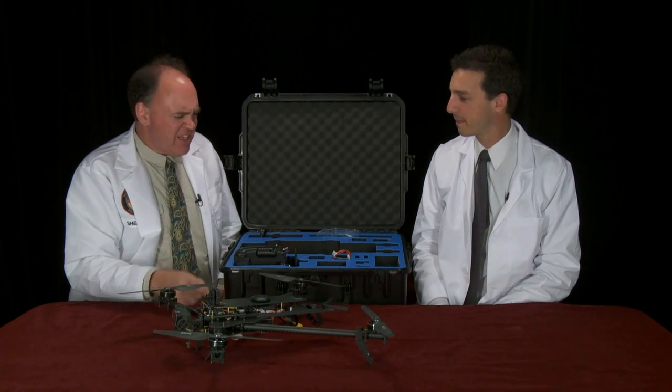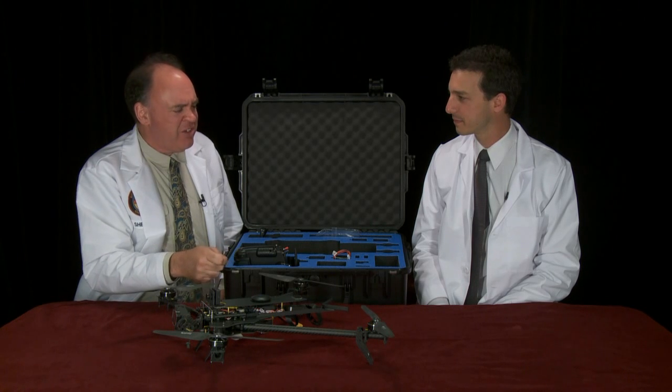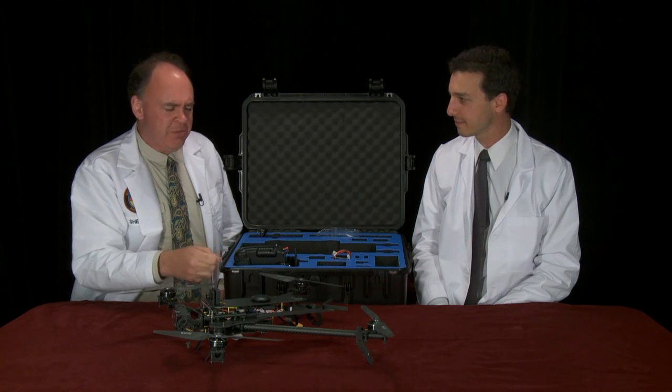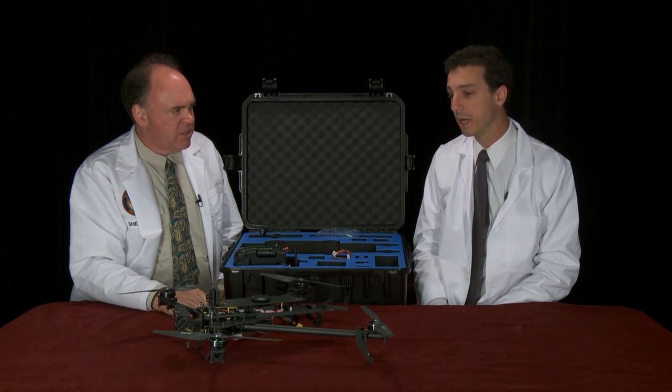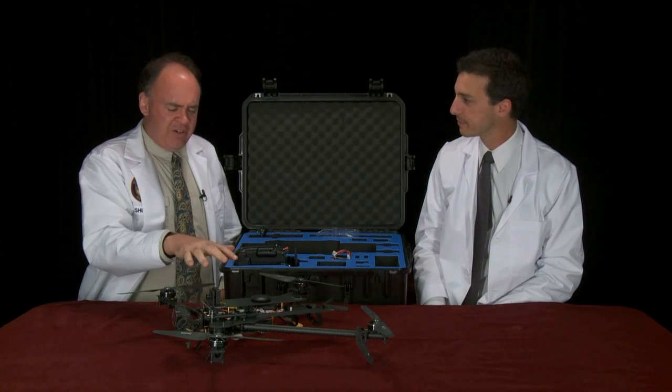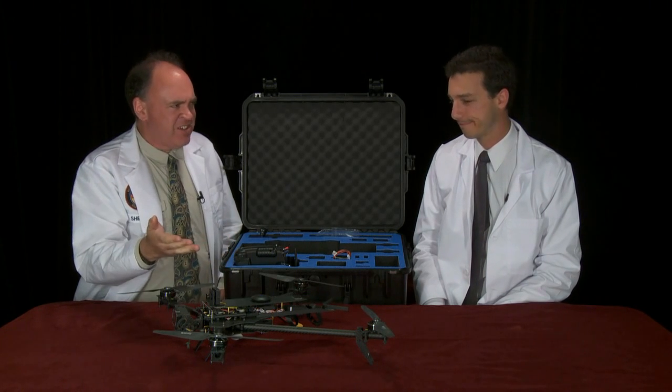Techon Stein was grousing about it — he said the L9R is not an easy unit to come by; he tried to order one and couldn't get his hands on it. This is a new release by FrSky. They've taken the X8R, which is the standard receiver packaged with the Taranis radio, and added a bit more range at the cost of the telemetry feature. But with this aircraft you've got an OSD, so you don't really need that telemetry anyway.